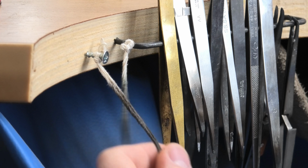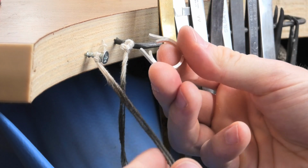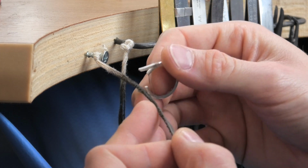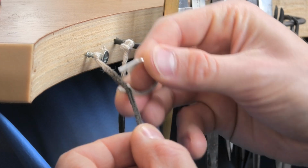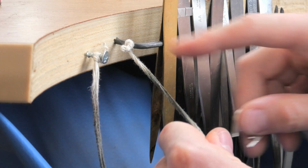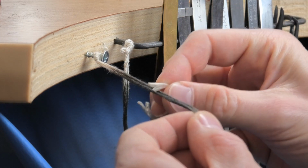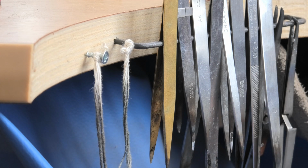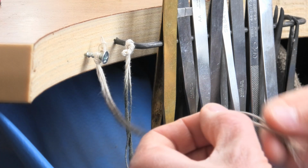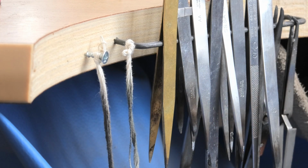Alright, next nugget is having polishing string attached to your bench. I use this a lot, like on this ring shank I made recently, it's in the other video, the Pinterest one. Getting in there, I've got one section of string for the tripoli grease, and the next one for the only green I use on there. So it's just good for getting in places, polishing things up, getting things finished really nicely. So it's very useful to have bits of string, just a bunch of it tied up, screw it to your bench, and it just sits there, always ready for you.